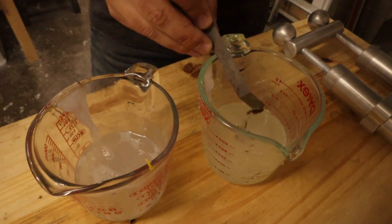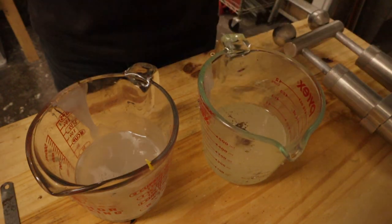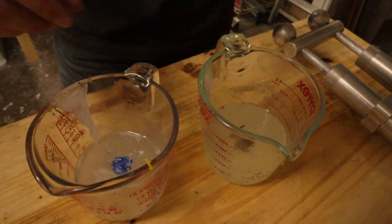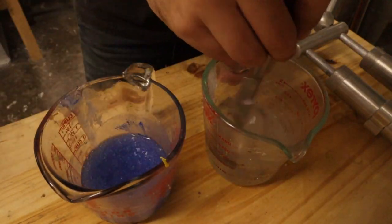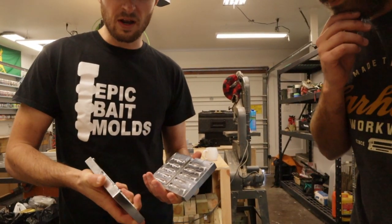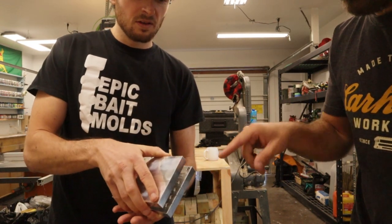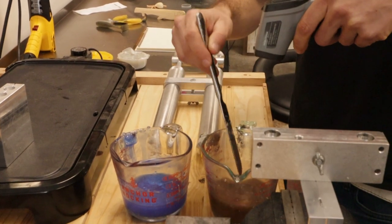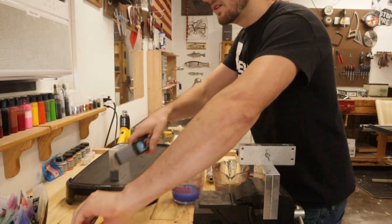This is mahogany — very nice color — and this is like a sparkly blue-brown top with a blue belly. This will probably be the most natural-looking bait we make today. The pond we're going to has exceptionally clear water — you might remember it's Kevin's — and there's wiper. Jason will have the honors of shooting the first 1.7-inch headless laminated Epic prey bait in this shop. The back is the side without the little groove, and the belly is the side with the mold maker guy on it. We're working at 337–338°F — let's do it!